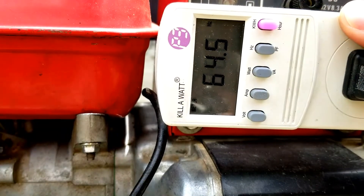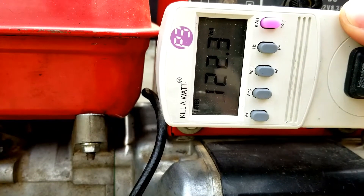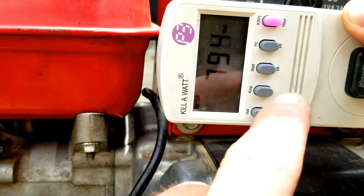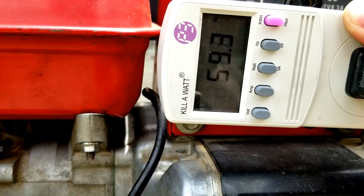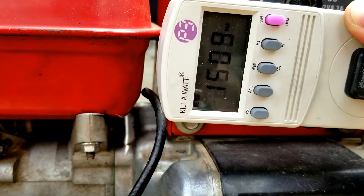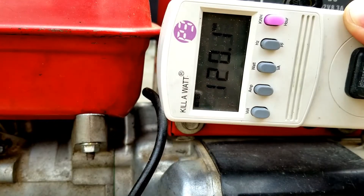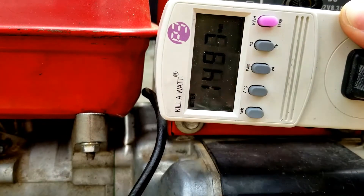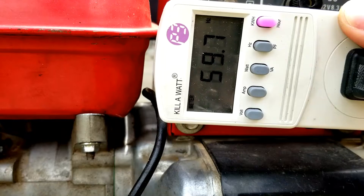There's no load on it, no watts. So I'm about to hook up a toaster — you'll be able to hear it slightly bogged down. I'm going to push one side down first of the toaster, and then I will push the second side down. So you can see one side is now down, I have just shy of 800 watts. My Hertz has now dropped to 62. Now with the other side pushed down, I've dropped to 59 and a half Hertz. So this generator needs just a touch of an adjustment to get up to 60 Hertz, but not that big of a deal. 1500 watts with both sides of the toaster down, and I have 120 volts, just shy of 60 Hertz — right on the sweet spot. And then once I remove the toaster, you'll be able to see the numbers bounce right back up.